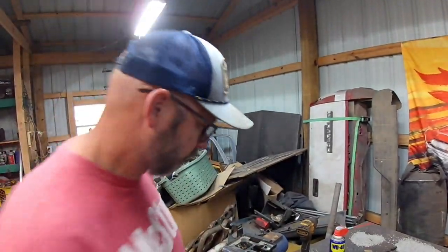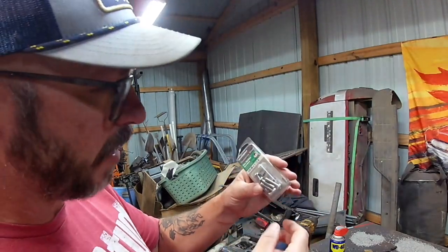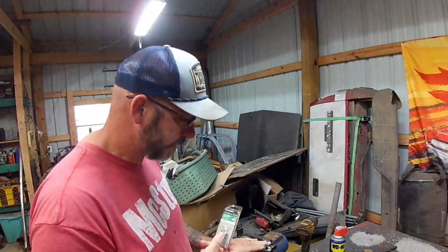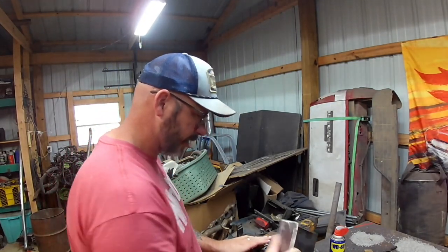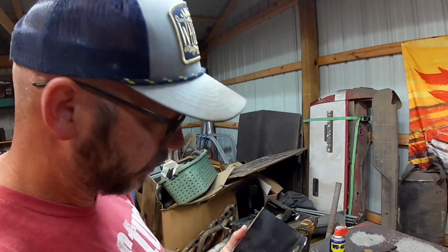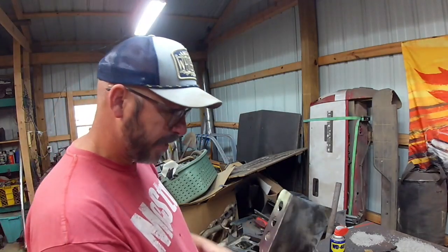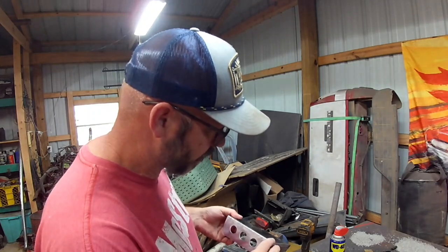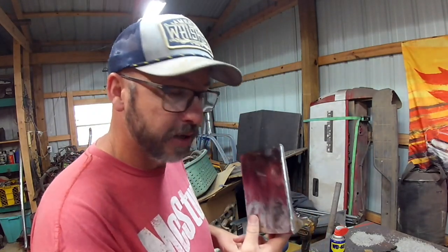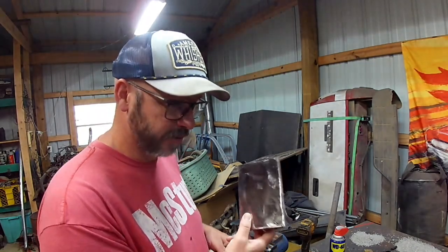We're back. It's the next morning, and I found some 1/4-inch bolts with Phillips heads on them, the rounded heads, so I don't think they'll hit the bottom of the fuse box. We're going to drill some holes in the plastic piece, and then transfer those holes over to the metal piece, and probably do a little more cleanup underneath because it's got some WD-40 on it. Then we'll paint this, and while that's drying, we'll do a little more touch-up with the grinder. But while that's drying, then we'll work on marking and drilling and mounting the other piece that we need on the fender well.